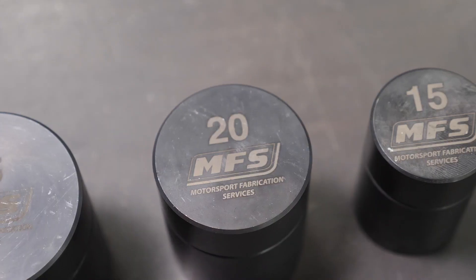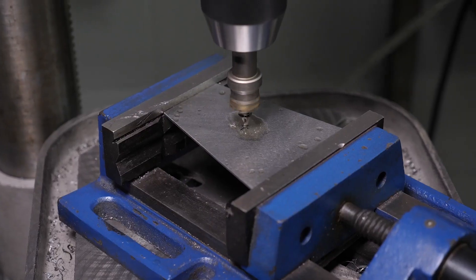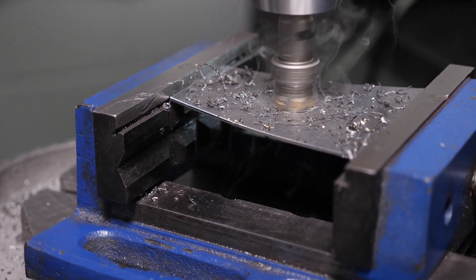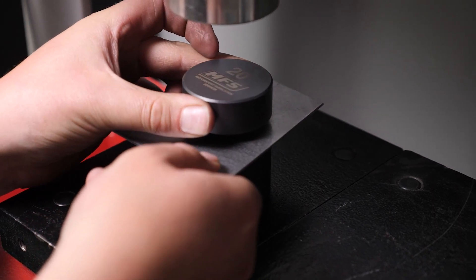For the purpose of this module, we'll go through the process of using a hole saw to produce the hole for our dimple die. We've chosen a 20mm dimple die, which means we need a matching 20mm hole saw. Before drilling, we need to carefully mark the desired location and centre punch it to provide an accurate reference for the pilot drill. We can then secure our work piece in a drill vise and use our drill press to drill the 20mm hole. With the hole complete, it will require deburring before we locate the two halves of our dimple die through the hole.